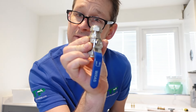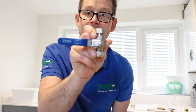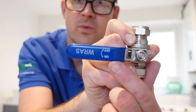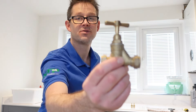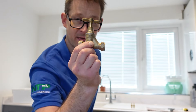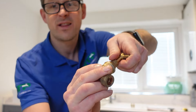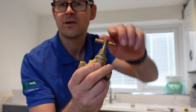If you don't have an isolation valve, you may have a quarter-turn valve — though these are quite expensive so a plumber may not have fitted them. You just go 90 degrees and it even tells you what's on and off. If you haven't got either of those, you need to find the stop tap, which is normally under your kitchen sink or in a utility room. If you haven't got one of those, you'll have to turn the water off in the road under the man cover — just turn it off all the way, and when you turn it back on, simply open it up.